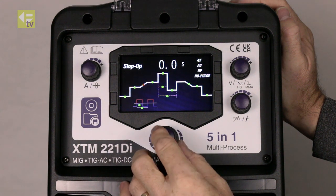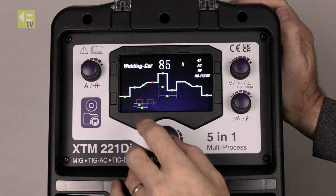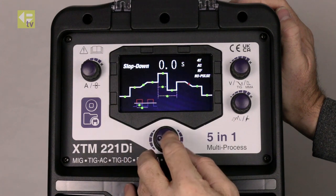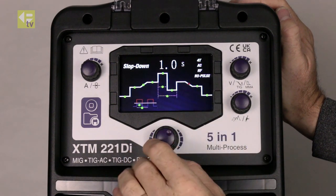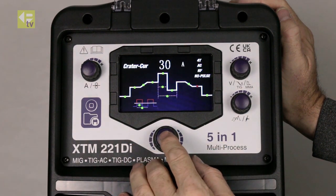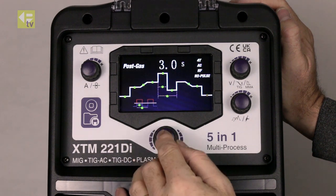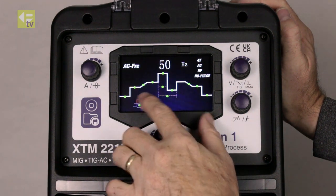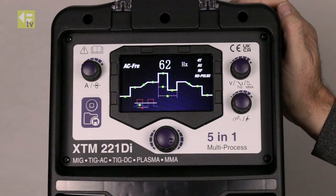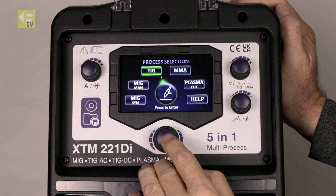Slope up time — I can adjust that by pressing. Press again to deselect. Welding current — let's go to 97. Slope down time — as you can see we've got the flashing red dot; press it again and the red dot goes solid. Back onto the final current — I'll increase that. And then here I've got my post gas time. Around here then to my AC function — AC frequency I can adjust. So in manual mode you can adjust every single parameter as opposed to preset mode.